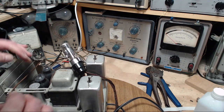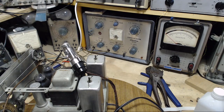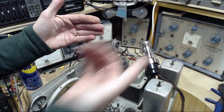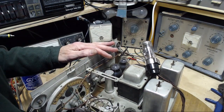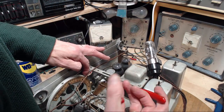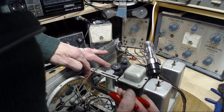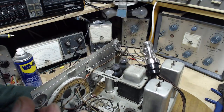Almost got it off. Yeah, it's a wrong bulb. That's the wrong size bulb in there. Can anybody see anything going on? So it's the long 47, and that's why a lot of this trouble's happening. So I almost got the cowling off. I can just kind of force it off here. There it goes. Come on out. Oh my gosh, what is holding it? There it goes. Got it.